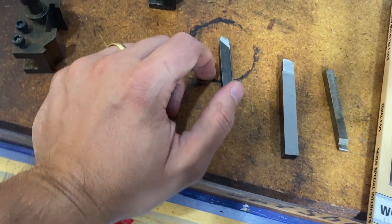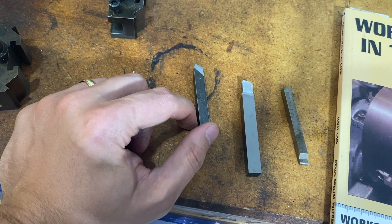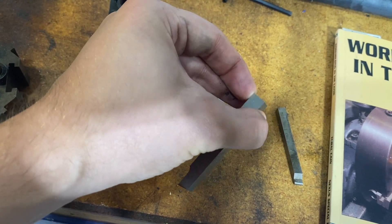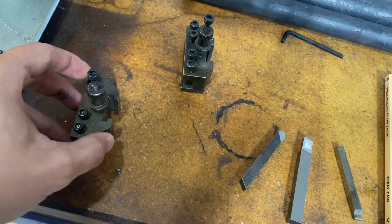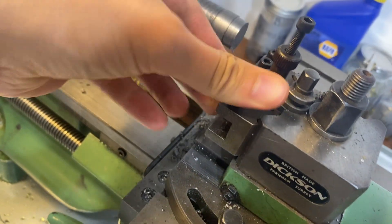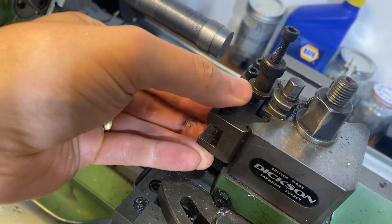The other thing I'm working on right now is making these cutters. These are high speed steel blanks. What you do is you get these blanks — and if you look at this side, they kind of come like that — and then you can grind them on the bench grinder into cutters. Then you mount those in your tool post holder right there, put it on the lathe, tighten it down, and then it's firmly in and ready for work.